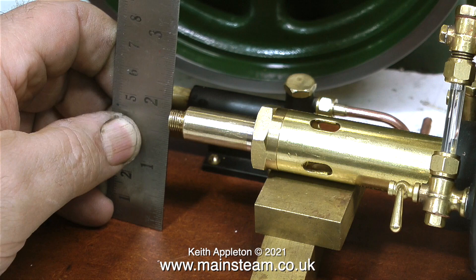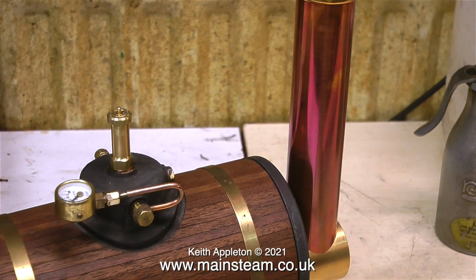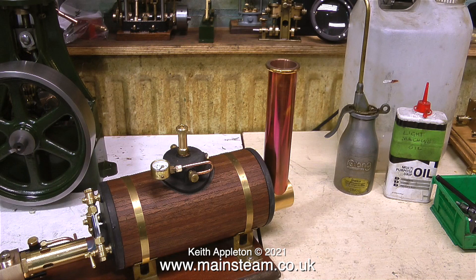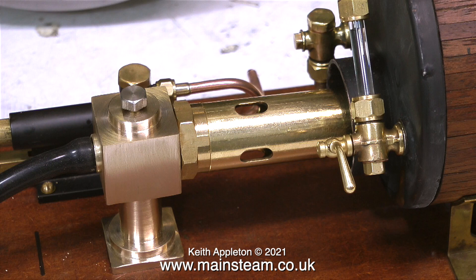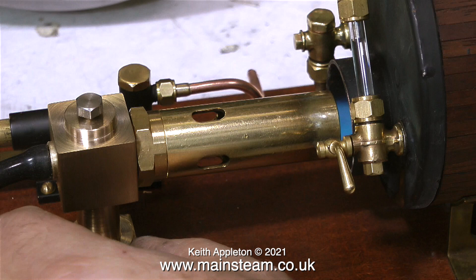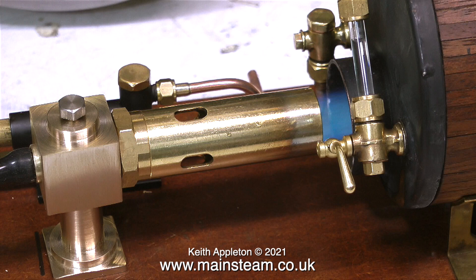You have to be very careful when using gas that you don't get any leaks. So that the mounting didn't just look like a lump of square brass, I machined it on my lathe to make it look a little bit more pretty — it's still not a thing of beauty but it does the job and it's a very secure mounting. What you can't see in this clip is me sniffing the chimney. There would be a very bad smell coming out of the chimney if the burner was in the incorrect position and the gas was not being burnt properly. But once I got it in the right position I put a mark on the baseboard and it's now burning very well — no bad smell at all. With this arrangement the boiler raised steam very quickly indeed and my carbon monoxide detector in the workshop remained silent. The burner position is really quite critical — within about a quarter of an inch in fact.